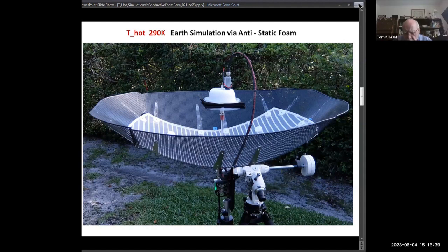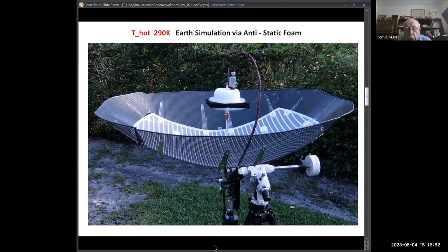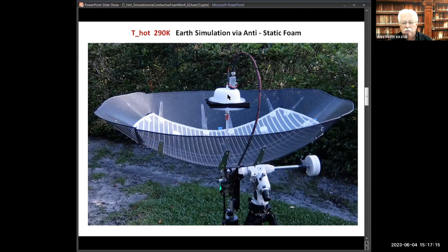I was wondering on the 2.4 gigahertz feed, if anybody's taken that apart and extended that out to 1420. I started doing that, but the problem is it's so exposed. This has the little choke ring around here, but the sides are so open to the ground environment that I don't think you'd really get a good system temperature. I haven't tried it. Maybe that's something you could do. It'd be worth the effort.